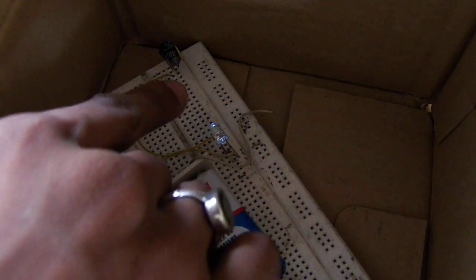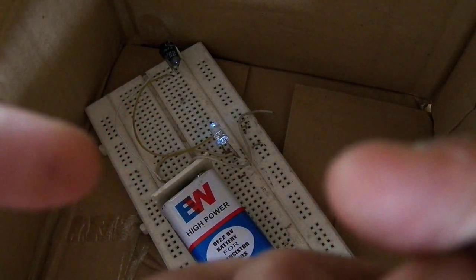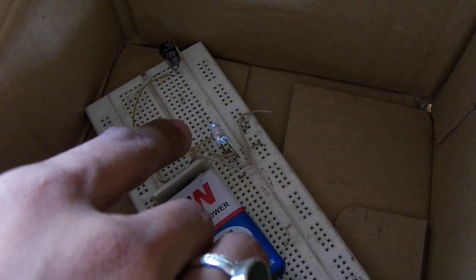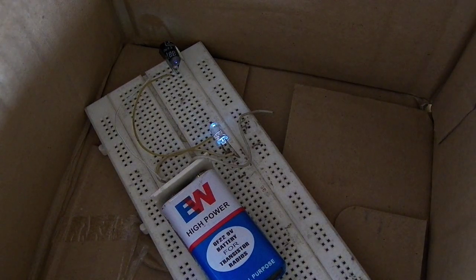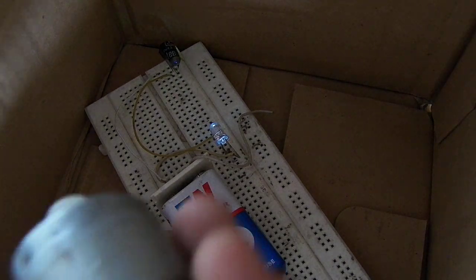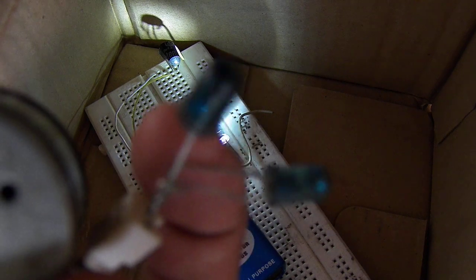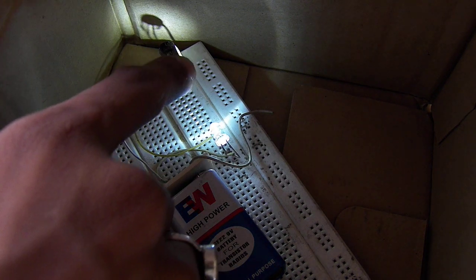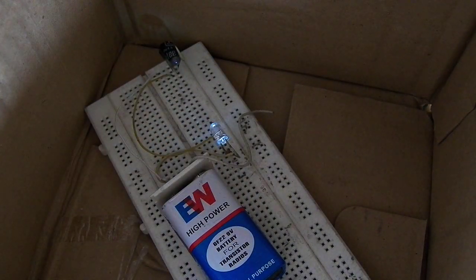What's going to happen is that this LED and photodiode are exactly opposite to each other. So this photodiode is sensing the intensity of the LED as well as the intensity of light present in the natural environment. When I spin this motor, I am adding extra infrared light into the environment, and the photodiode senses that light.